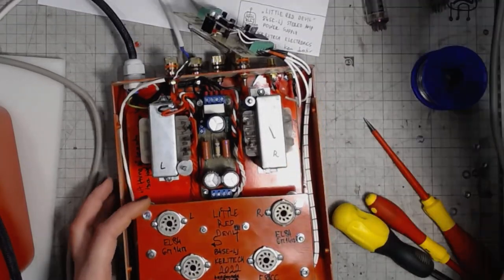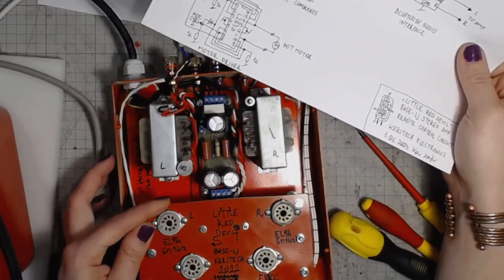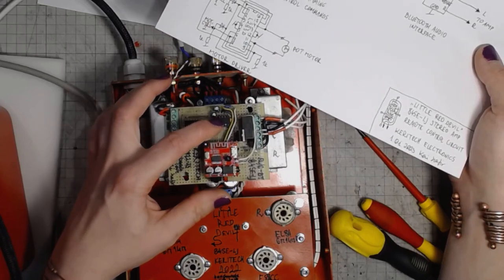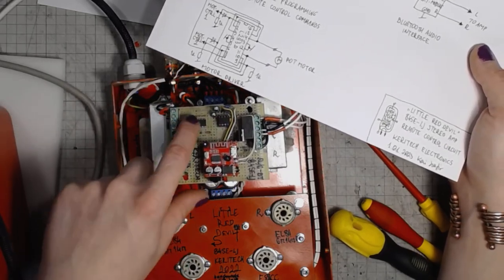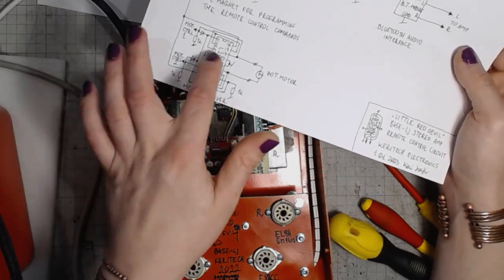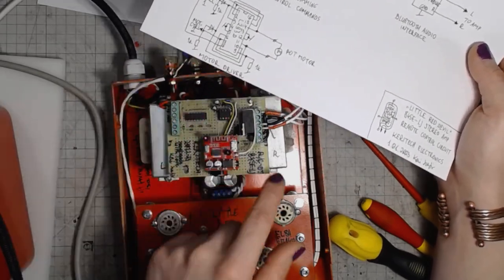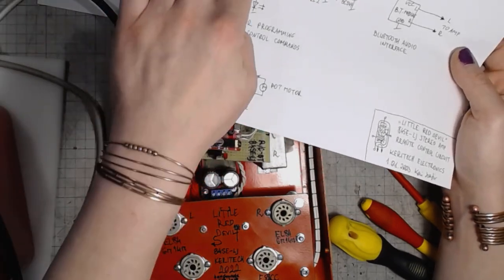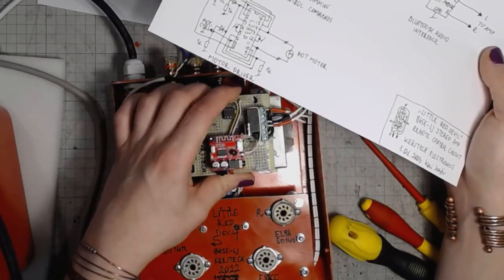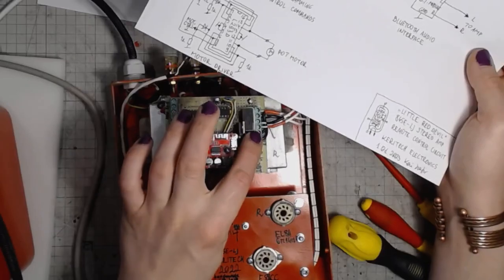And now the more interesting part, the control circuitry. It uses an ATtiny45 microcontroller unit, an L293D motor driver, which is a double H-bridge where I connected both halves together, and the infrared sensor that feeds into the microcontroller. One of the outputs of the microcontroller goes to the relay switching circuit.